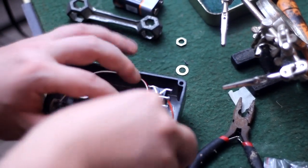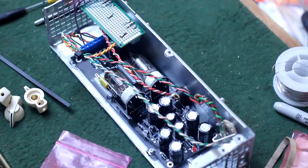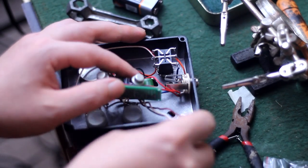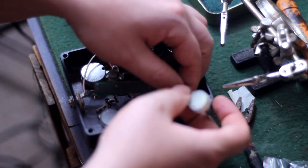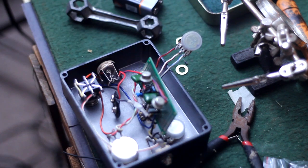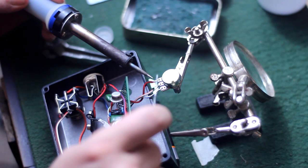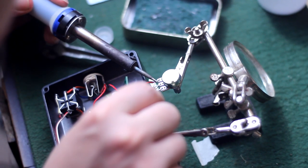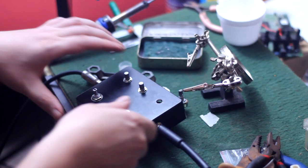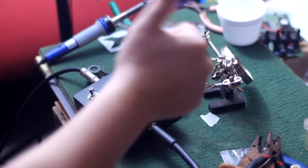Now you'll notice on this and much of my other work, like pretty much any amps or pedals I build, I twist my leads. Now this helps couple the wires and it acts more like a shielded cable and it makes quieter operation. But this also makes you be able to twist or untwist your leads for lengthening and shortening. And that really saved my ass in this situation. I was able to clip that pot off and get enough lead out the end there to cleanly solder up this pretty shiny new pot, which I should have used in the first place. And you best believe that this time I'm gonna test this mother of all things good before I put it back together. Excellente, we may proceed.